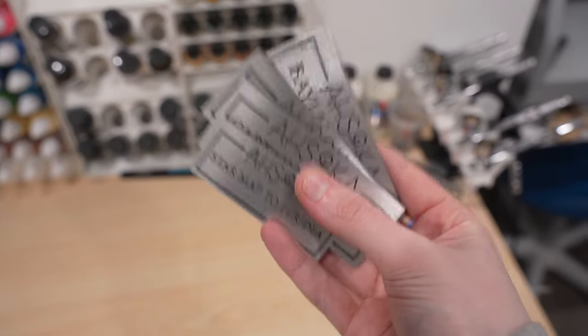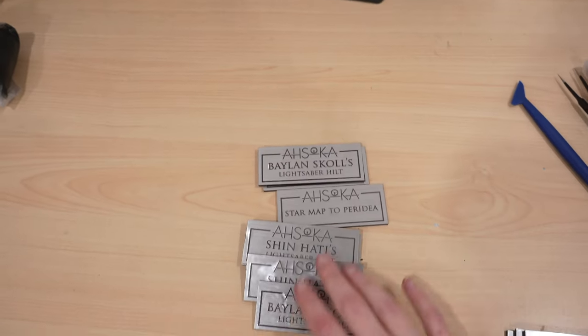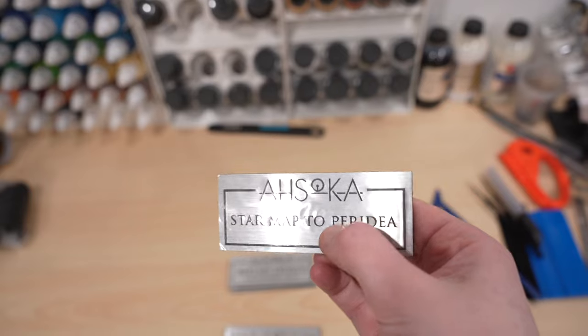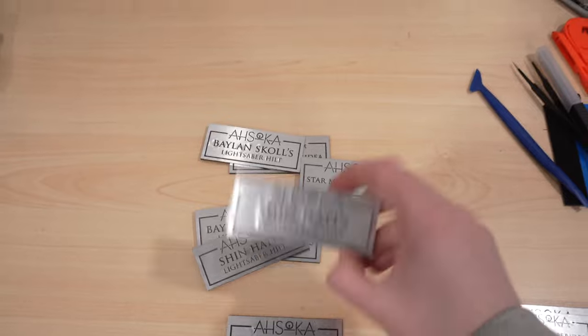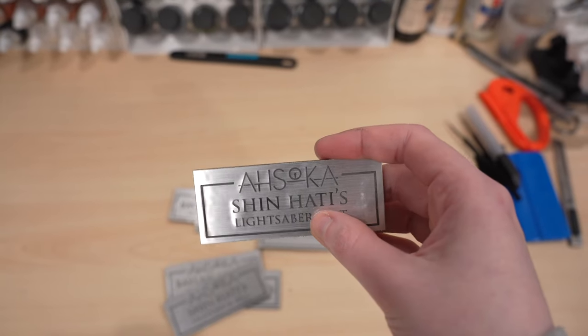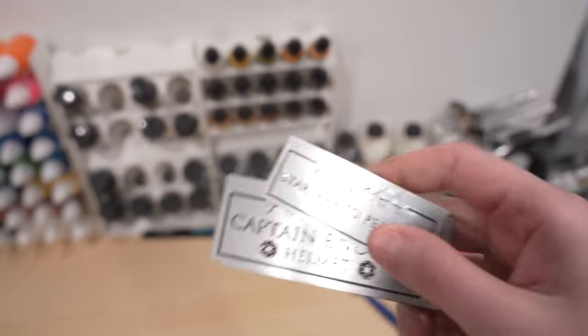This was also an engrave-and-then-cut project. These plaques were the first things that gave me any sort of issue — I have a whole stack of extras from messing around with settings. I realized the vinyl was bubbling and thought it might be due to the heat, so I was turning down the laser power and speed. But I realized I actually needed more laser power, because the bubbling was happening when the laser wasn't cutting all the way through the vinyl. I did work out a pretty good speed and laser power ratio for these.